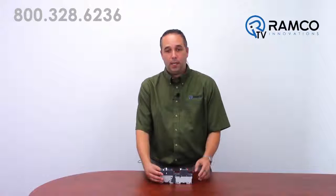These manual motor protectors can be close coupled with a traditional standard contactor. This assembly is a combination motor controller. As you can see, this assembly is much smaller than the previous examples and only requires three wires in and three wires out.